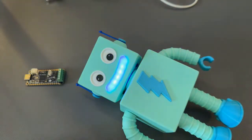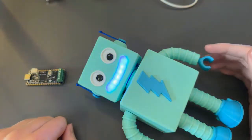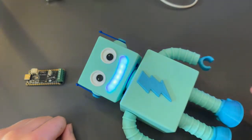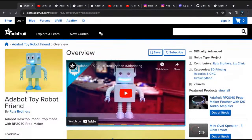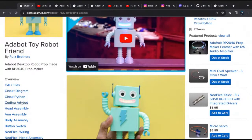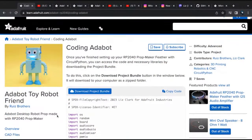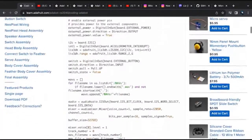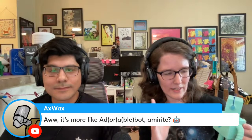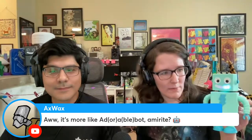Do you want to talk about the LED animation library? So there's the LED animation library in CircuitPython. Basically there are these very popular animations that folks would normally want to do, whether it's a fade or a Larson scanner style thing. And it's non-blocking, which often when you're doing NeoPixel stuff can become kind of an issue. So with the LED animations, I can just have these different animations queued up and in different modes have different animations play, and easily change the color too, which otherwise can get a little tricky.